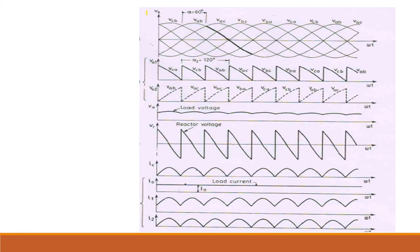The load voltage V0 is the average of the two converter voltages: V0 = (V01 + V02)/2. When one converter output is at a high value and the other is zero, adding them and dividing by two gives the midpoint value. Between those extremes you get some maximum value. This is how you draw the V0 waveform.